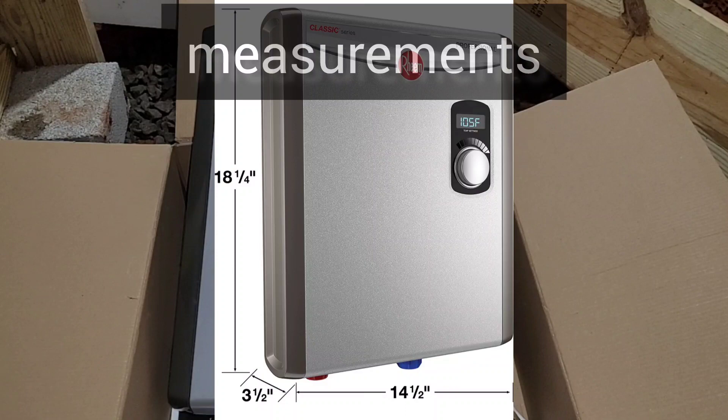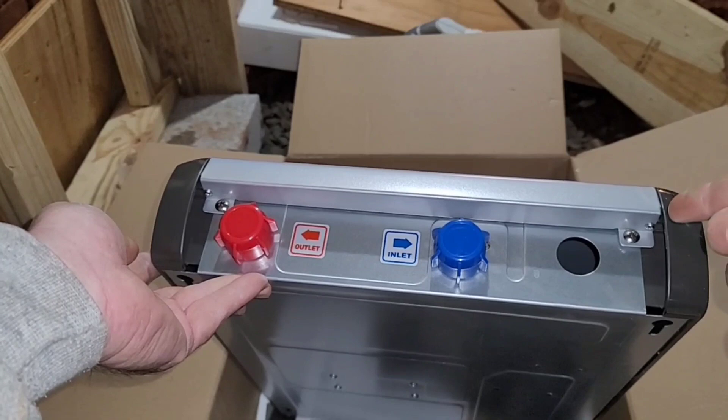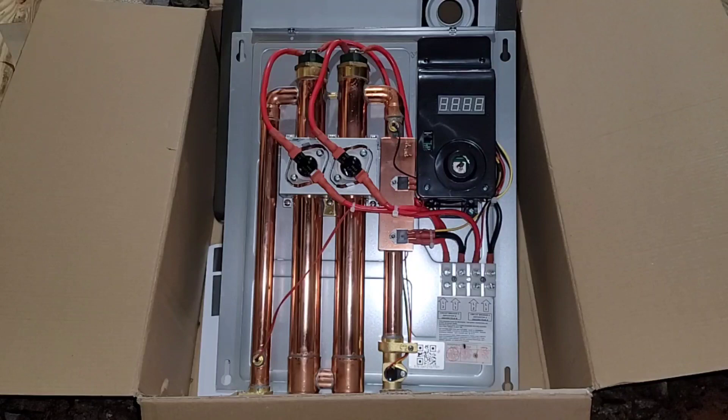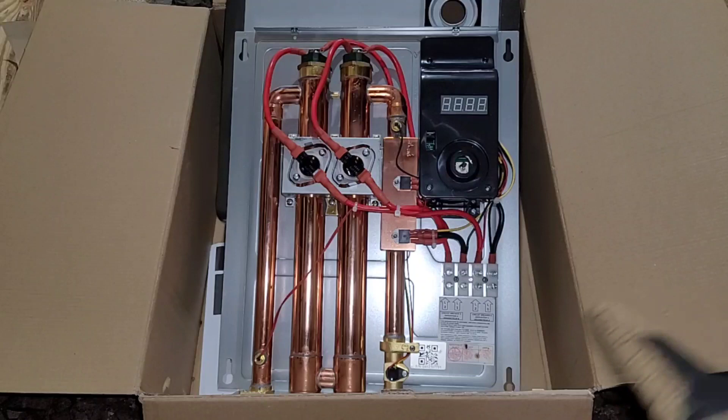This unit is just over 18 inches tall, 14 and a half inches across, and three and a half inches deep. To take off the cover for installation, there are two screws on the bottom and two on the top — take all four off and set them aside. With the cover off you can see the four corners where you mount the heater to the wall. This did not come with any screws, so you have to get your own. On the inside you'll notice two cylinders in the middle — those are the heating elements that heat your water on demand.